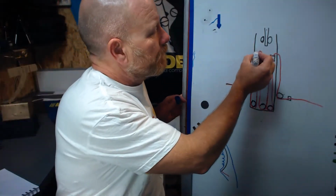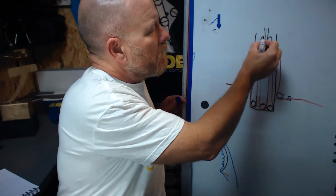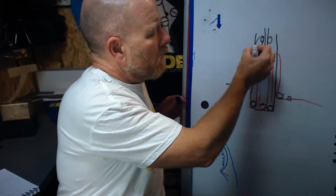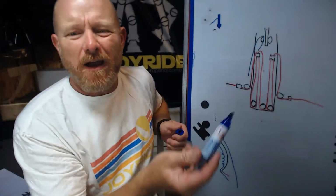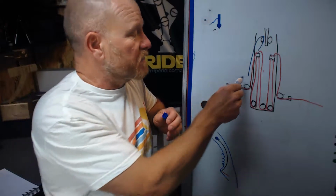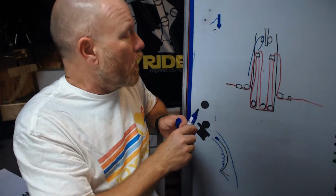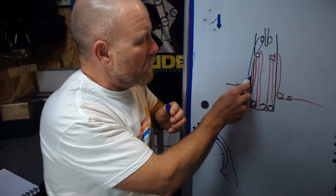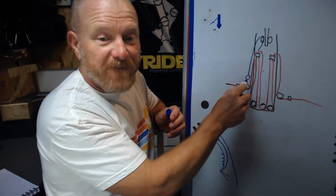Yes, we have. So from here, we've got a line going from here round the block, which is in the sail, and then it comes down the mast. And then there's a variety of different ways that could tie off. Maybe your mast's got a cleat on either side, like on a Tiger, you'd have a cleat on the side of the mast where you can actually adjust that. But it just needs to fasten there.